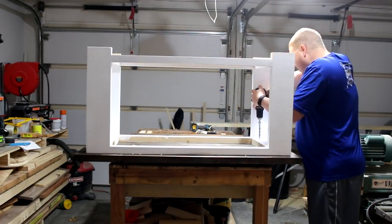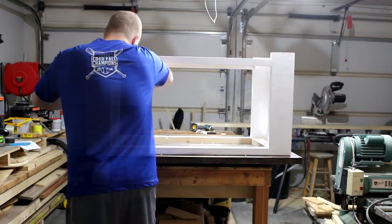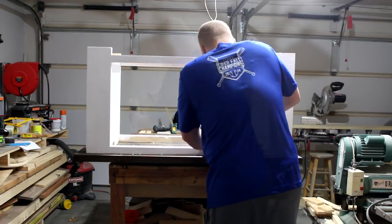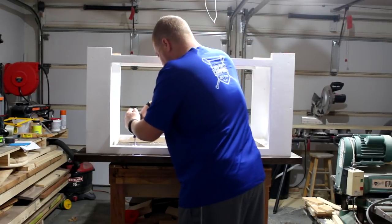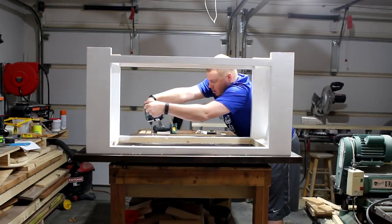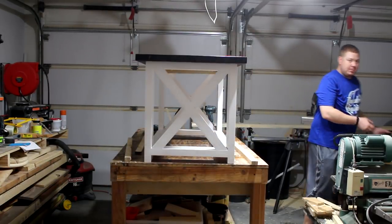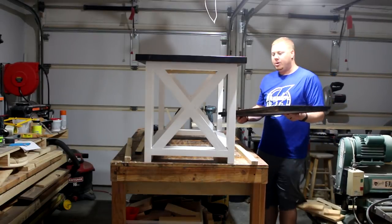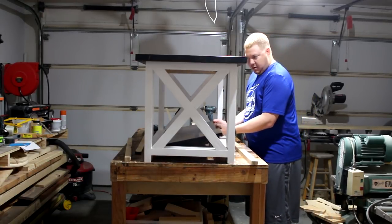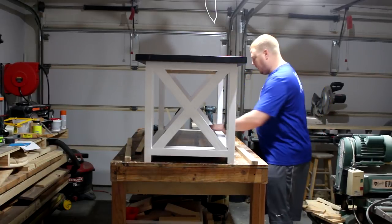What I decided to do here is to use my pocket hole drill bit and drill holes in the top, as you can see here. After this, I'll come back and attach the top with pocket hole screws. I feel like this will give me the best secure hold on the top, and it makes it where I can take it off later if I need to. For the bottom shelf, I've decided that we're just going to let it sit in here — we're not actually going to secure it down. Just drop it in here just like that, and that is going to complete this little guy.